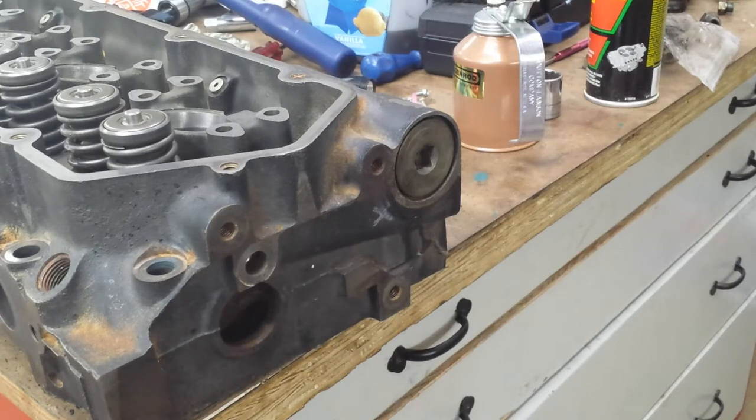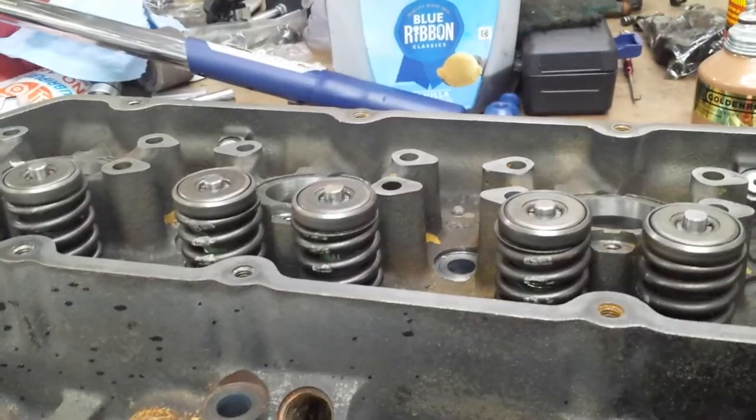And don't forget, that's the full high-pressure oil from the high-pressure pump. So it's 3,000 pounds at times. And it can be 3,000 pounds anyway. So that's a lot of pressure on those seals. And if they're just a least bit loose, I would imagine they would be flooding the engine compartment with a lot of oil. So be sure to include the thread lock.